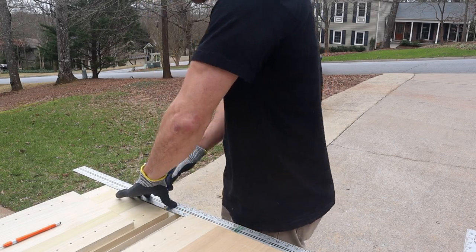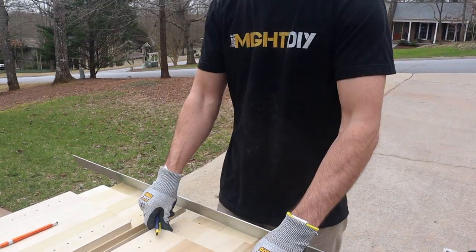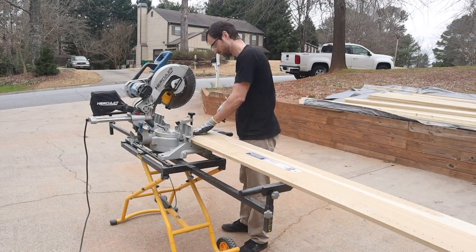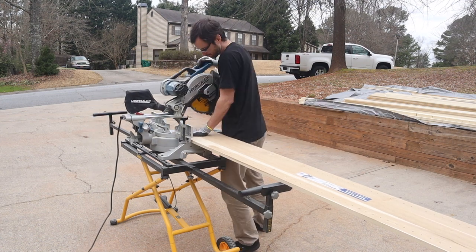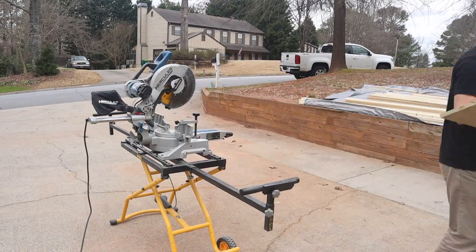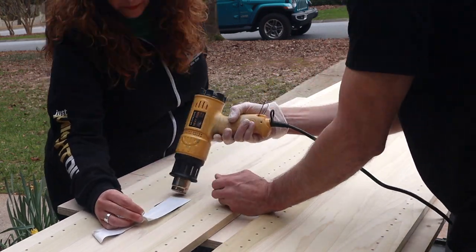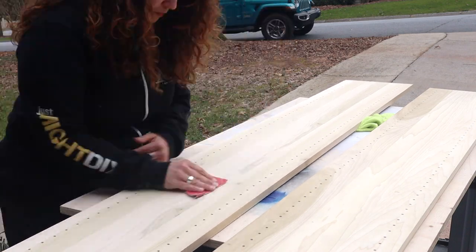As with all wood we get, we true up the ends using a common measure from the bottom and top of those peg holes. When trimming, we use a good new finishing blade for our fine cuts and make two passes to help avoid tearing up the wood. A gentle application of heat helps peel the stickers, and a quick sanding picks up the remaining residue. This is important because some paint doesn't like sticker residue.